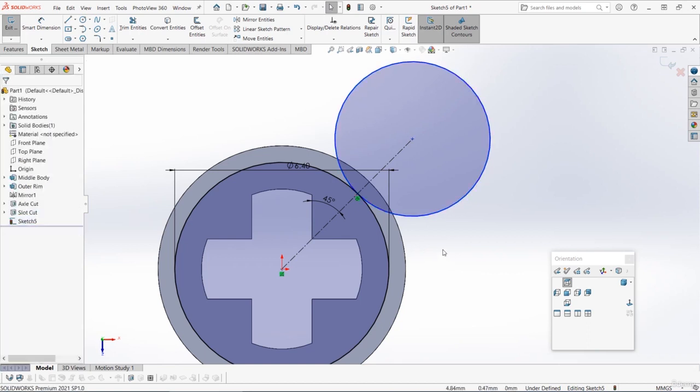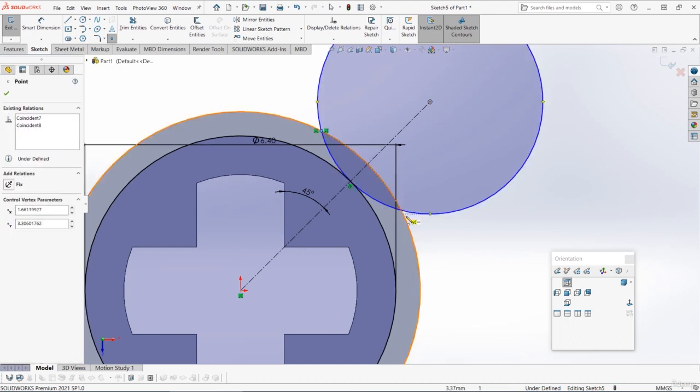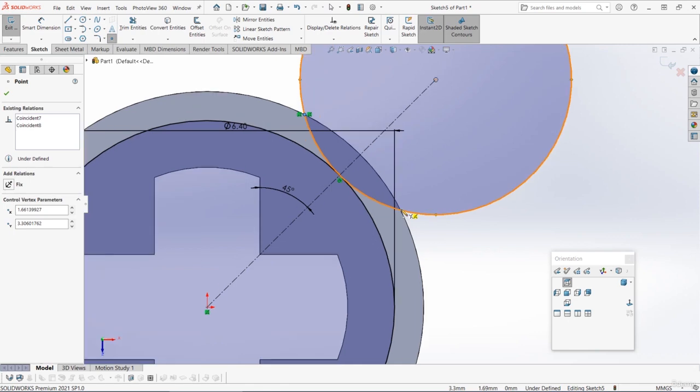And to do that, I measured the cut across the outside, between here and here on the real model. And that should be 2.3 millimeters. So I'm going to get the point tool, and I'm going to add a point on that circle, which is also coincident with that main outer circle. So we want to add these points where the sketch circle crosses the main outer circle. You should just be able to hover over the intersection and add the point directly.